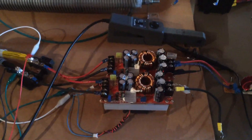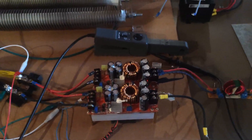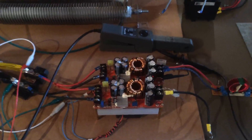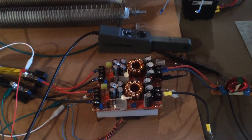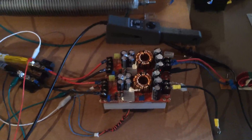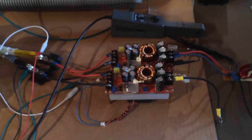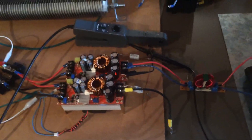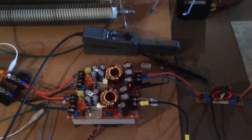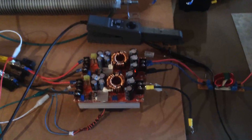But there are a couple of other concerns with these modules, and just with power supplies in general. When you use a power supply on its own it can generally regulate properly and you can filter noise, but these particular units when you use them in parallel you have a load sharing problem. One of the modules is basically going to produce most, if not all, of the output current, and the other remaining modules will output very little. So one of the main issues is load sharing.